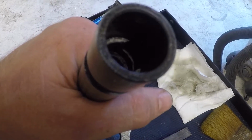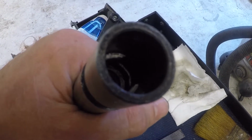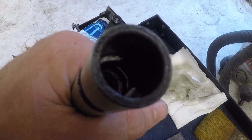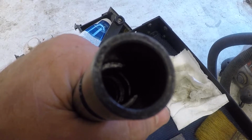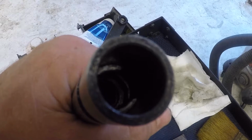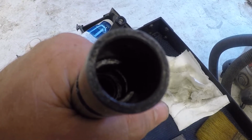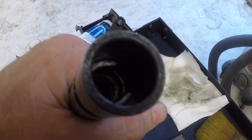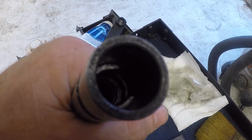All right, there's a new problem. You can see the drive dogs there, but in between them, there's a little bit of an edge. They did a really poor job of machining this, and that edge is catching, and it's smaller than the 3/4 of the hole that we need. So I'm gonna update the model and the program again to just cut a little bit of a shoulder around this part. I'll probably just take off 20, 30 thou around it, and we'll cut some more.